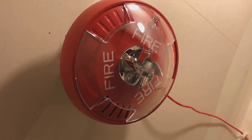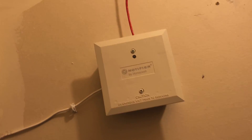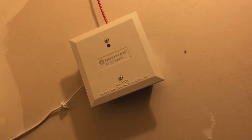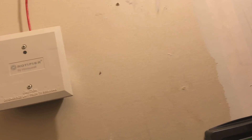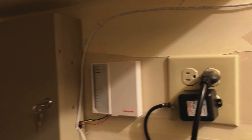Over in the closet, we have the ceiling-mounted Wheelock Exceeder horn strobe, which is also set to sync and 75 candela. We originally had a 49-to-3 there but it didn't end up working really well — we had some problems getting it to sound off. The device still works, the panel still works, it's just the converter I have seems to have been overused a little and it's dropped down on us. The annunciator is over here, so we'll reset here at the end of the video. We have the security system but I have that disabled right now so it doesn't beep the whole video.